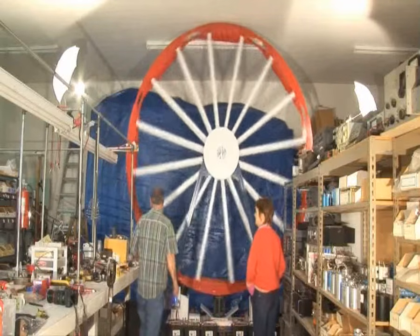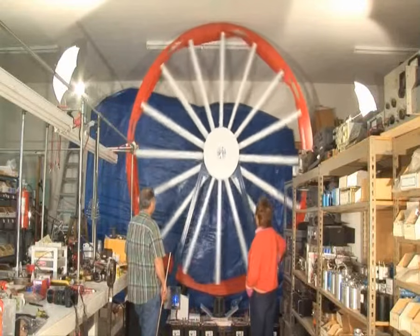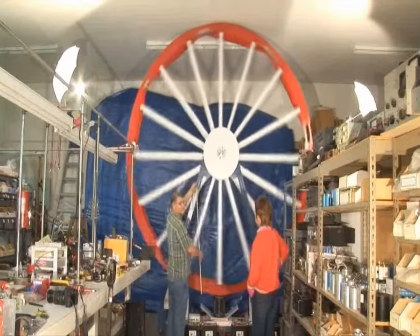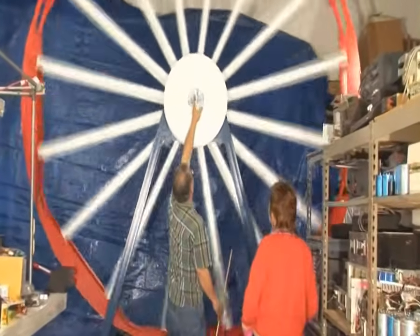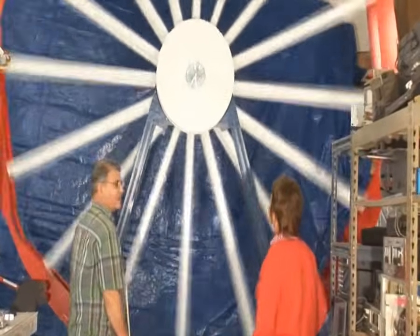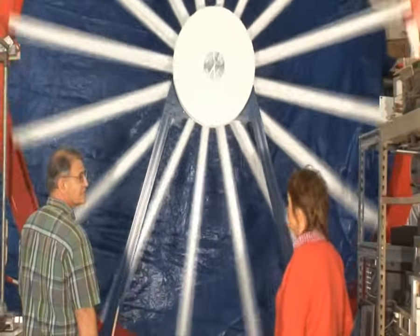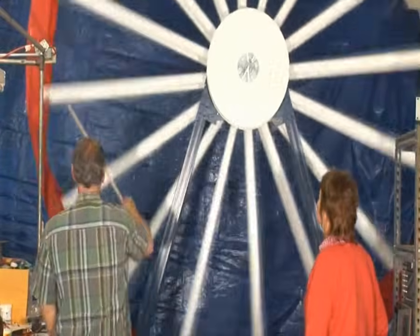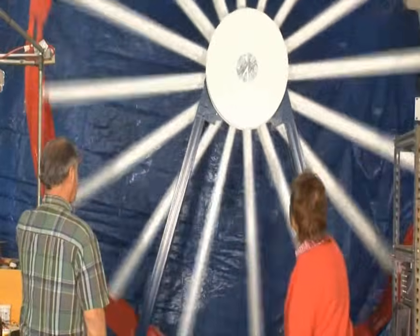So it's doing 17 and a half RPMs in a minute with a lot of torque. Because remember what I said, you've got this lever way out here at 6 feet, and there's tremendous torque there right now because you've rotated this 300 to 400 pound mass up to that many RPMs. So look at the surface speed if you watch it go around. It's pretty quick.